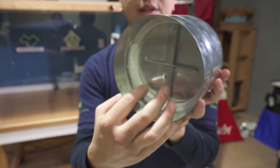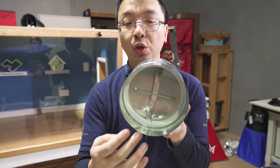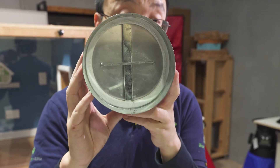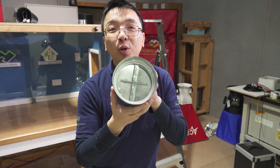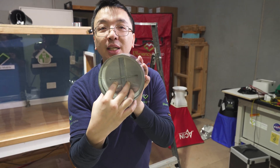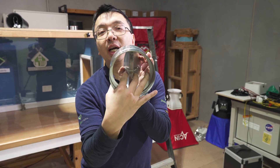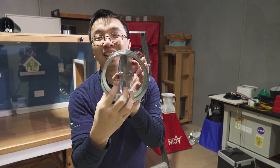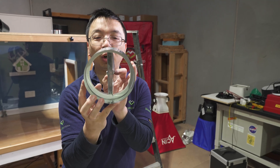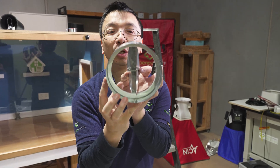The next option is this type of in-duct Draftstopper, the Butterfly Draftstopper. This type is controlled by a spring — it is spring-loaded — so you have a bit more option to control how much force is required to pull open the flap. However, the control mechanism itself creates a shortcoming. If we rely on a spring, that means the more the Draftstopper opens, the higher the force required to keep it open. If you want full exhaust when the fan is in operation, it cannot easily be opened fully because the spring pulls harder the bigger it opens, and it's quite difficult to control.